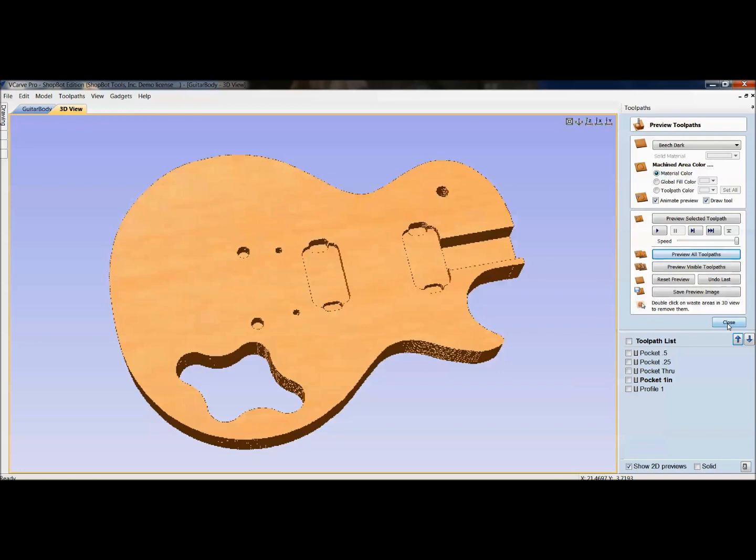And that's just one purpose of the probe. Hey, this is great, but you've got to remember too, with a probe, you're replicating it in 2D or 3D, but depending on the resolution and the part size, is the probe really the best thing to do? Yes, for this it was fine for me. It's just a one-off that I'm doing. Sometimes you might want to consider even sending it out to a 3D laser scanner, where they can laser scan that and get the resolution perfect, where you wouldn't have needed to do the node editing. So you just think about what's in your budget, what is your time frame, stuff like that. So just things to think about outside of just using a touch probe.